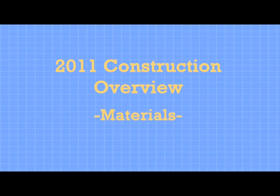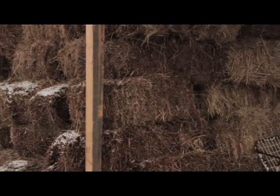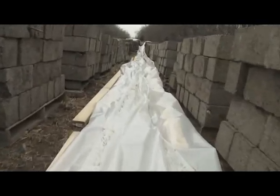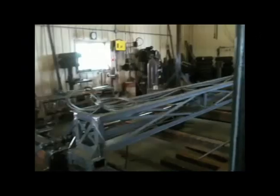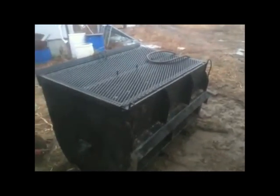Now the materials. During this year's construction, we baled hay from our land to generate a total of about 900 square bales for insulation. Then we pressed 17,000 bricks. We put them on pallets so we could focus on pressing all bricks first, then laying later. We moved the bricks to storage and put them under cover from the rain after dark on every day of pressing. We hoped to use the sawmill for lumber production, but the sawmill is now only 75% complete. We also tried pressing stabilized lime bricks, or DIY cinder block equivalent — bricks made from finely crushed limestone stabilized with cement. We mixed with a pulverizer and pressed a dozen samples with satisfactory results. For larger production, we tested the cement mixer, but it was not particularly effective at mixing the reject lime. It needs some modifications, so we will save the full DIY cinder block production for next year.